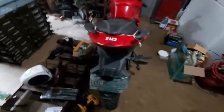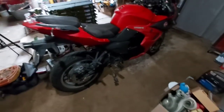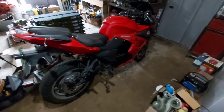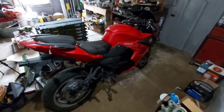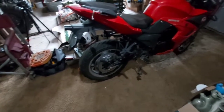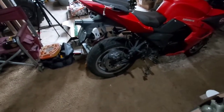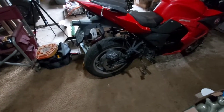I'm going to take the batteries out, give them a good charge, and put them back in to see what happens. Supposedly this thing has already been modified a bit. I kind of want it to go around 150 kilometers an hour rather than just 32. I may buy a new hub motor for it — it comes with a 500-watt hub motor, so I'd probably upgrade that to about 5,000 watts.